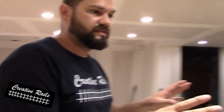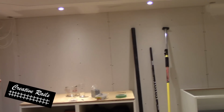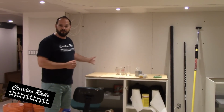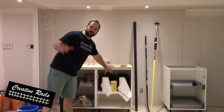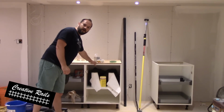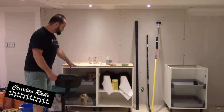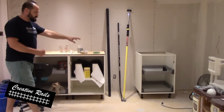So before we talk more about the railroad, I just want to bring you over to this area. Remember I said before, this is also going to be a home theater and a family room. So this main part here is the future area of the wet bar. So this cabinet right here, plumbing's already roughed in. I've brought it in over from the main. Got PEX coming down, drain all hooked up, ready to go. This is the plumbing cabinet for a bar sink. This is just an auxiliary cabinet for games and toys, cups, whatever. Same with that cabinet over here.